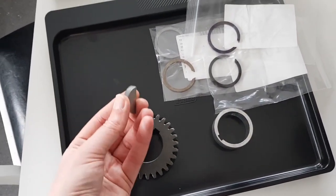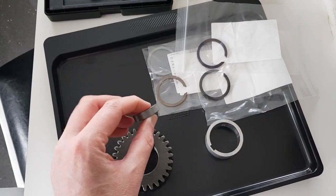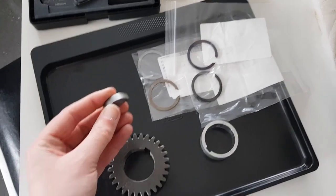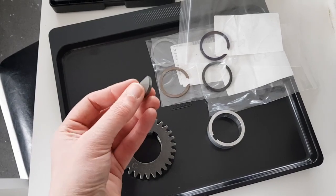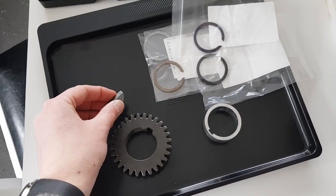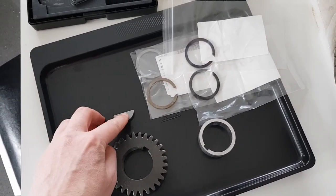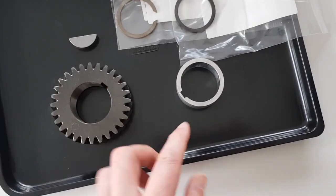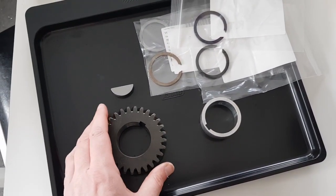Before they go on I need to fit this Woodruff key. I've measured the key — it comes out at 7.986 mm — and I've measured the hole as well, and it's within a ten-thousandth of an inch or so of being the same size. So that should be a good fit in the hole without needing too much force to go in. Once it's in the slot I need to make sure it sticks up by no more than 2.64 mm, because that's the height of the slot on the gear and also on the spacer — they're basically the same size — and then the gear will fit on.